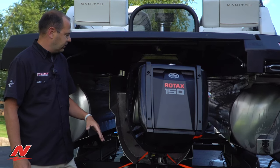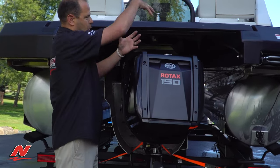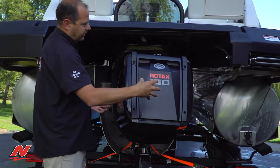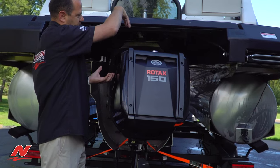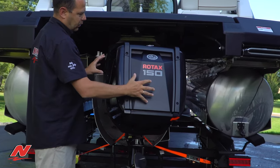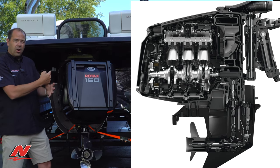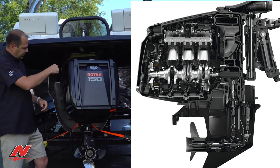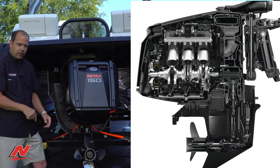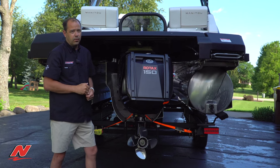The main difference is, if you were to look at this from the side, a normal outboard would stand up and you've got your lower unit on the bottom. This one, they took the power head of the outboard and rotated it 90 degrees. Your flywheel is actually right here. If you were to take this cover off, it goes into a transfer case, a gearbox, and then that transfers the power directly down into the lower unit. Much of even the lower unit components are the same as the old outboards.